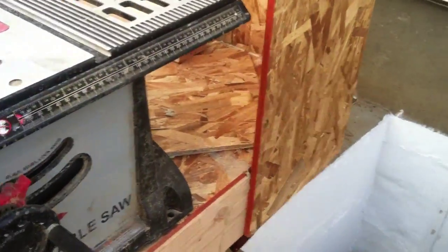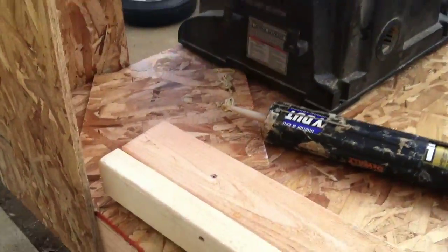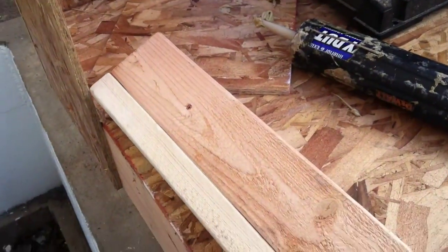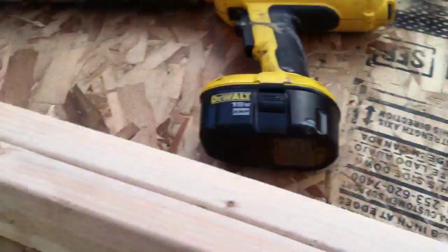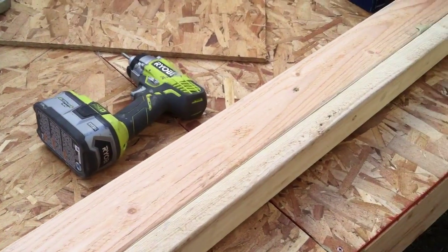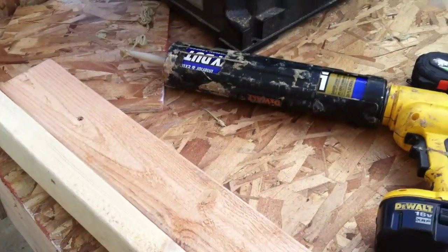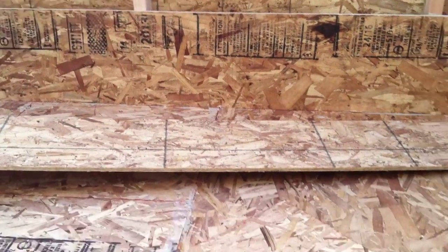These corners get placed at the bottom where I even everything up. I put one in, tilt it over, then put the other one in, and build a column on the deck. It's two two-by-fours — although you could use a four-by-four — but it's cheaper to laminate two two-by-fours together with glue, hold it with a screw. Then the two-by-three gets attached to the side so it can become a base for attaching whatever interior siding I do.